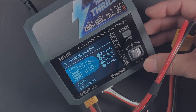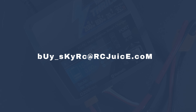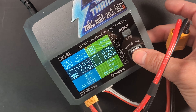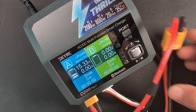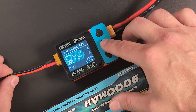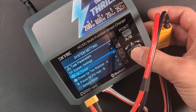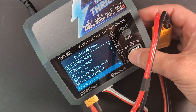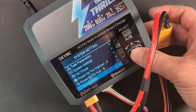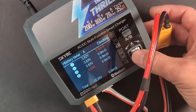Next, I want to show how you can access the hidden menu. You need to remember this password — I'm joking, of course. To get into the menu when the charger isn't active, do a long press on the scroll wheel of the D200 Neo or the enter button of the B6 series, and you'll get a whole list of settings, features, and additional information. The most useful one is the battery check.